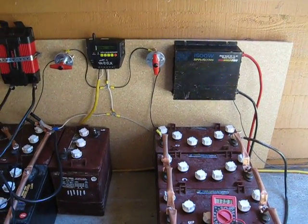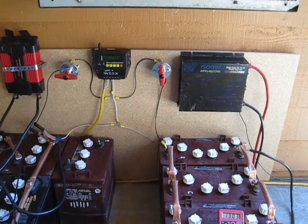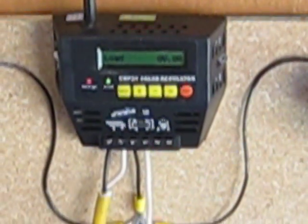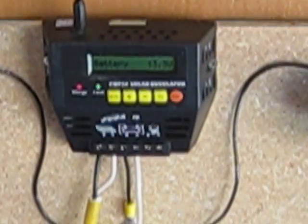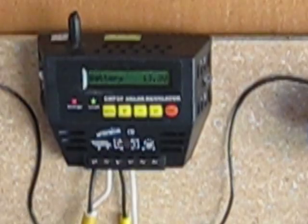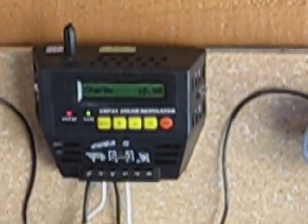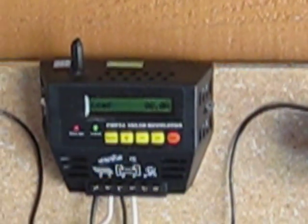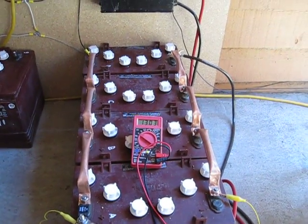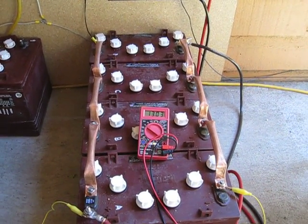Little update — it's 10 minutes after one and both solar panels are finally fully exposed. The load is still zero amps, getting 13.3 volts and 10 amps so far. It's been fluctuating at 10.1, 10.2 — not too bad. The batteries have jumped up to 1303 right now, she's doing really good.